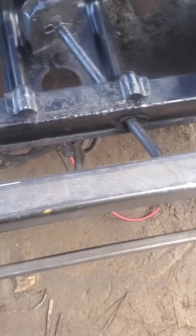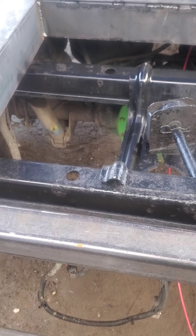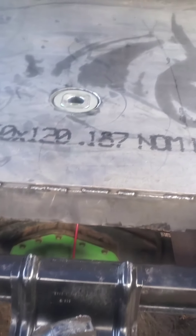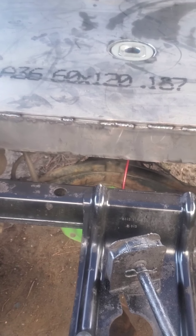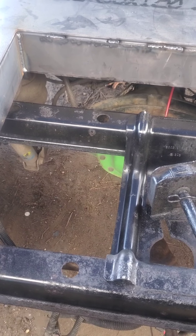If you've got plate laying around, use it — it's going to save you money. Even though it's ugly, it's going to be in there where I throw tools and it'll just get uglier anyway. I still got to make the back piece of the top plate. I've got about four feet left of that 5 by 10 sheet of 3/16" to do that. I crawled under the truck and welded a bunch of the framework on the underside yesterday, and added a bunch more welds on the gooseneck hitch.